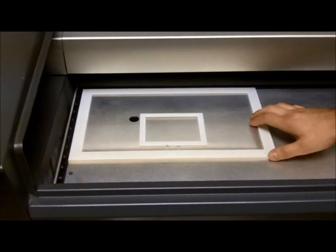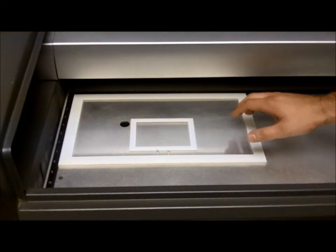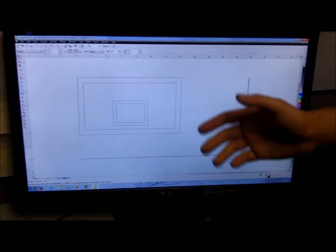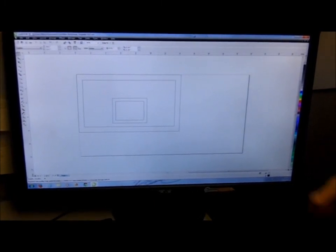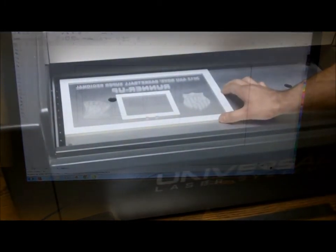As you can see, the acrylic is flat, just like any other acrylic sheet — you're going to engrave it the same exact way. What you want to do is put the paint side up and do a reverse laser engrave. Over here we already have the templates in CorelDRAW X5 files. They're all measured out for you. You definitely want to check and make sure all the measurements are correct on your machine before you laser engrave, as they might be different depending on the type of software.